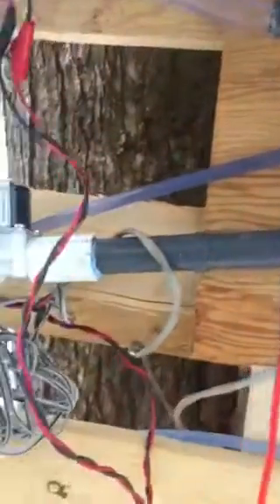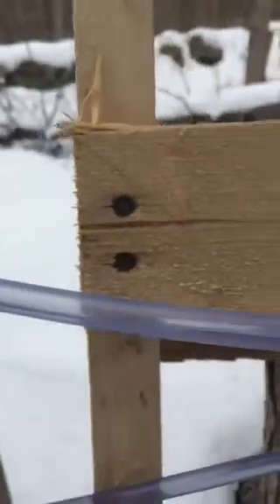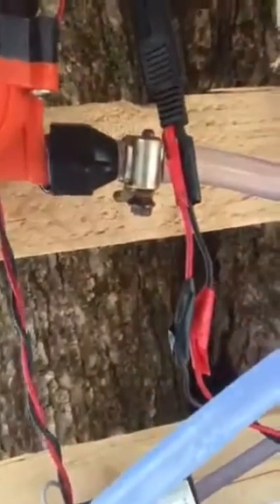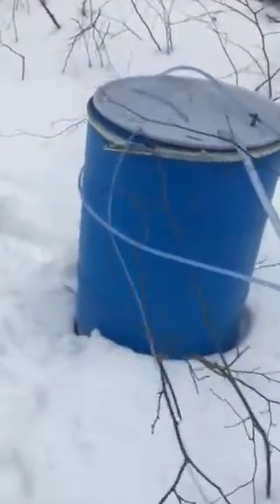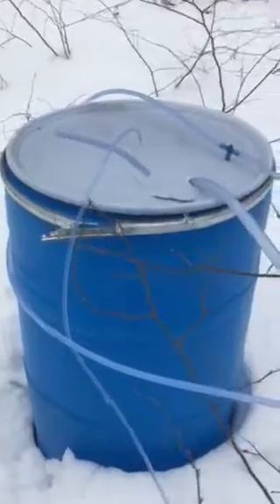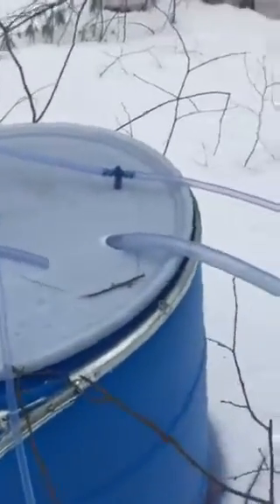This T is coming down to this solenoid valve here. The solenoid valve is shut right now. If you look closely, here's the line coming out of it and the sap is still. You can actually see some sap dripping out of the pump. I have it programmed every four hours, and the pump will run for about ten minutes — this is all programmable.